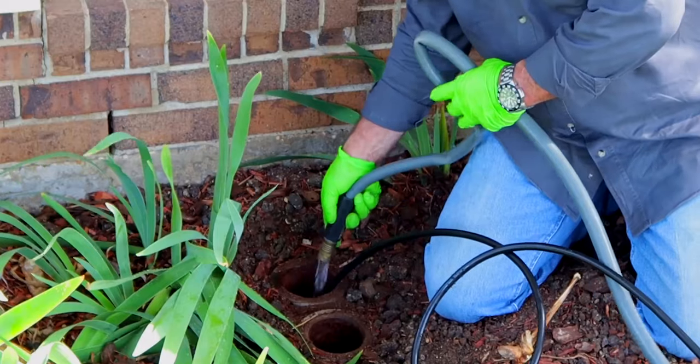Here's the thing: to do this right, all we're trying to figure out is whether there's a leak under the house. The homeowner says this is going to damage my system — no, it's not. Has your system ever stopped up before? Did the water in there cause any problems other than leaking out around the fixtures? Here's what's going to happen to do a hydrostatic test right. I want to do a sewer water test.